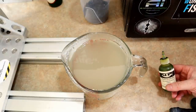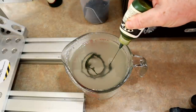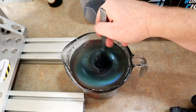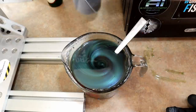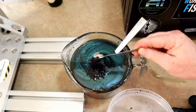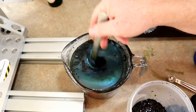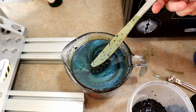We're going to make a really sexy color - watermelon blue by MF, which is absolutely gorgeous. It's like a watermelon with some blue highlight - absolutely beautiful. Since we're starting with just a big bulk solid color, I wanted it to be something pretty special. Now we're going to add some large-size black flake, 0.062. Sometimes a little accent color like small silver or small blue would really complement this well, but we're just going to go with large black flake to keep things simple. I think this will look really, really nice once it's mixed in.